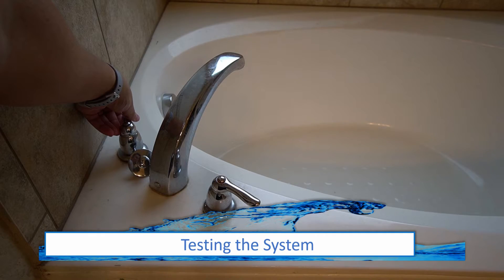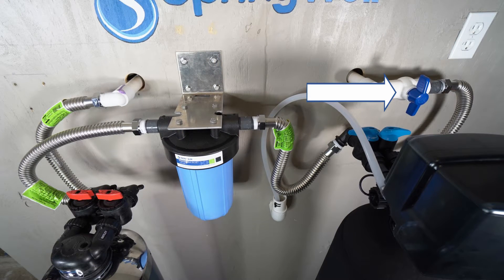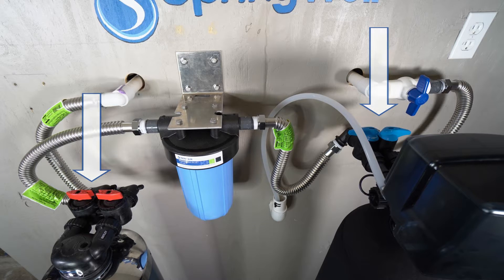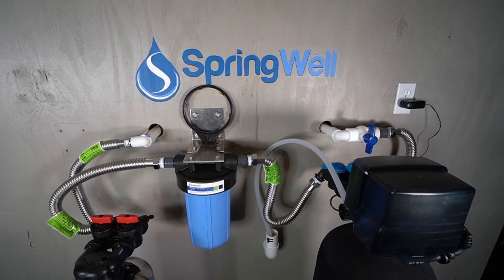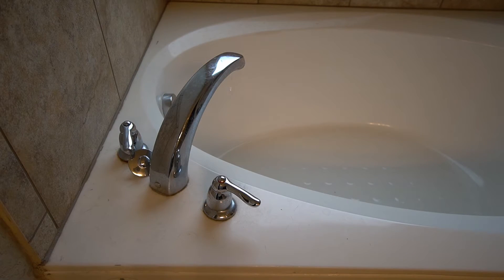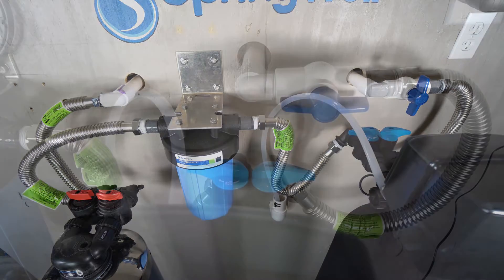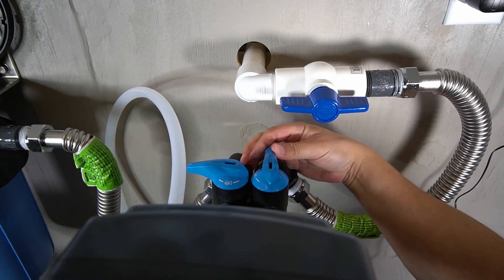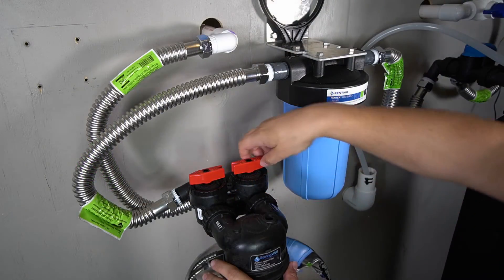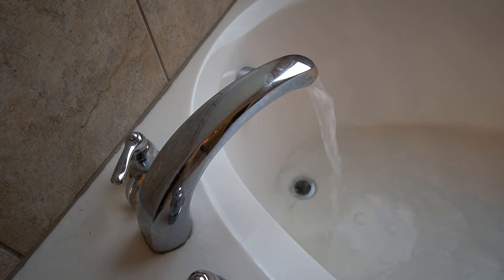You are now ready to test your system. While the water is still turned off to the home, turn on the cold water all the way in one of the bathtubs. Ensure the shutoff valve to the system is in the off position, and also ensure that both tanks are set to bypass. With the shutoff valve in the off position, go ahead and restore water to the home. Verify that there are no leaks coming from the shutoff valve. If no leaks are detected, open the shutoff valve — water will flow through the tank bypasses and through the pre-filter, and will also begin to flow into your home. Inspect the tank connections and the pre-filter and ensure there are no leaks. If none are detected, turn off the bypass and allow water to flow through your well water filter. The bypass can also be shut off from the salt-free softening tank to allow water to flow through it as well. Allow water to flush through your system for 10 minutes — it's common to see a small amount of sediment during this time.